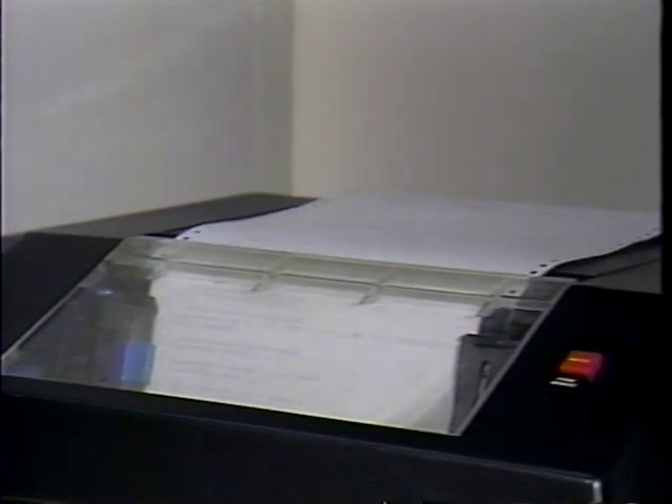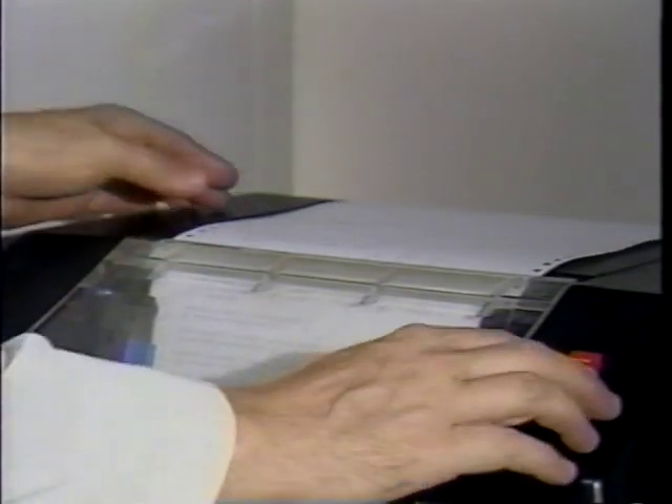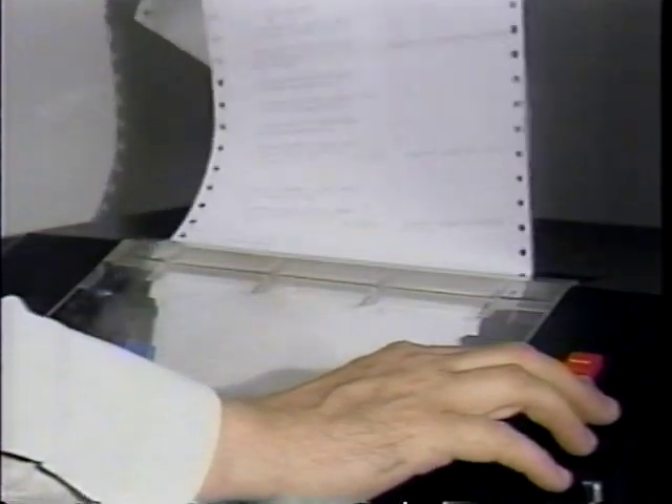And that's how to change a pack. Several points call for a review. To locate a suspected pack, you'll need to find the coordinates on the TLP printout. The first number shows the aisle number. The second number is the module identifier. The CM, SMC, or LTP number tells you which cabinet the pack is in. The last numbers give you the height of the pack from the floor and the location on the shelf.